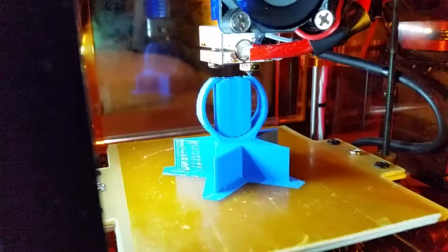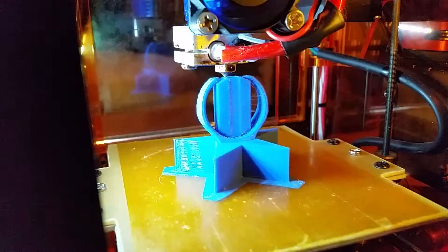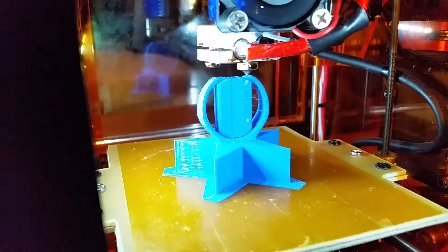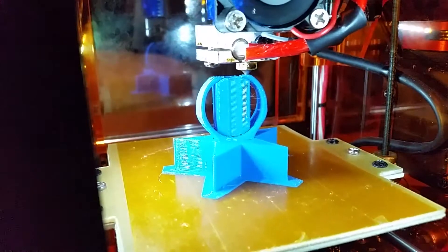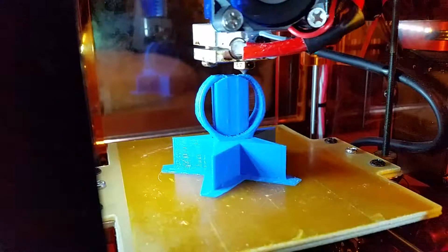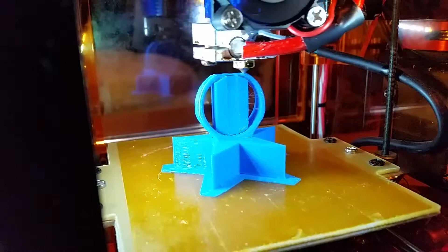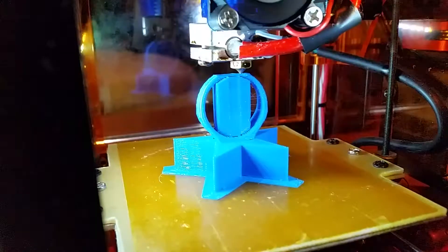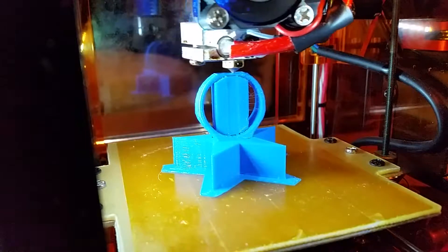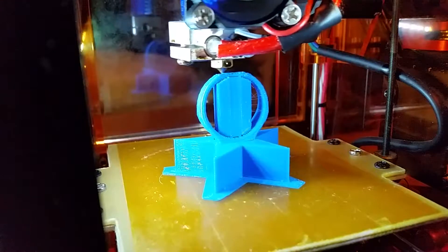That's also a function of how this design is — that support in there is actually pretty solid, so you do have to bust it out from the middle. But that's the one downside. This printed pretty darn good. The instructions say you're supposed to print it at 235 to 240, but the Fabricator Mini caps out at 230 — they hard limit and go into protect mode — so you have to stop that error by printing at around 220, knowing it might drift up a bit. I might try printing at 225 next time since my Fabricator Mini holds its temperature within about a degree, so I could probably push it pretty close. It came out really pretty good.